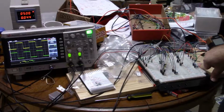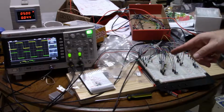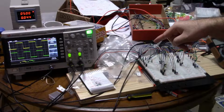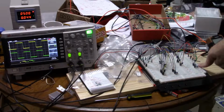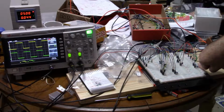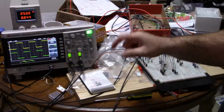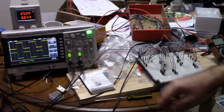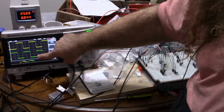And finally, these are actually used to reduce the resistance of my oscilloscope probes, because the oscilloscope probes are in series with the PNP transistor collector. That's what's connected to the collector, that's the load. But I have them in parallel with these resistors, so they have an effective parallel resistance with the same voltage drop, because this is measuring voltage. And of course, this is one side and this is the other. It's the two different loads that are on and off at opposite times.